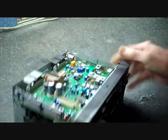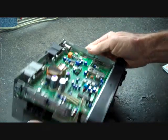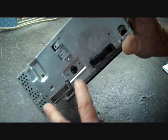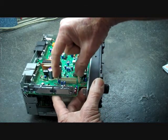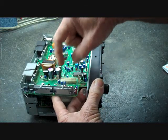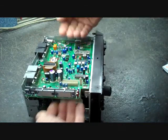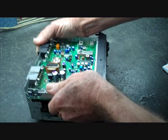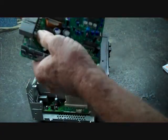What we're trying to do is remove this circuit board, because all three of these problems are on this board. To do that, after removing the side heat sinks, we're going to remove the pin that comes out of the back along with the screws along the back and the antenna. There is a connector at the front with two white pins on the outside that guide it into place — it goes all the way down to the main board on the bottom. We're going to lift this up, putting more pressure closer to the connector underneath, and lift the board out of the radio.